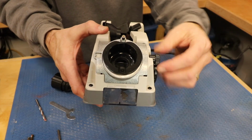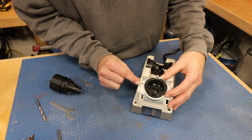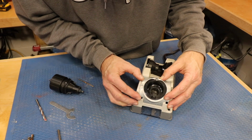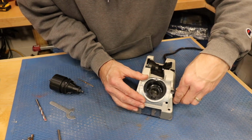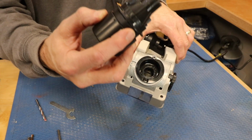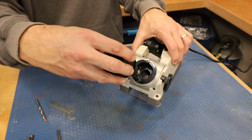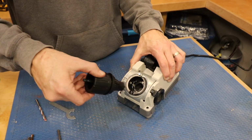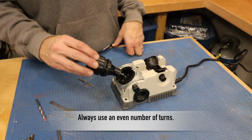Okay, so I just loosened this knob right here, and this will rotate back and forth. We've got to make sure this angle is set correctly. That's 135, that's 118. Just going to tighten that down. So then all you do is you turn this on. Like I said, you have that white tab sticking up. You point that towards that right there, stick it in the hole, and then give it half turns, 180-degree turns. So we're going to do probably 20 half turns.